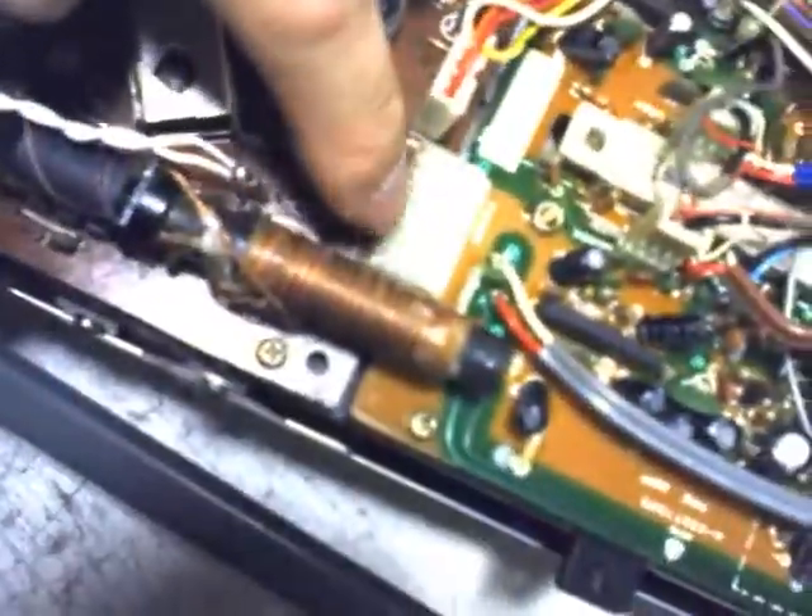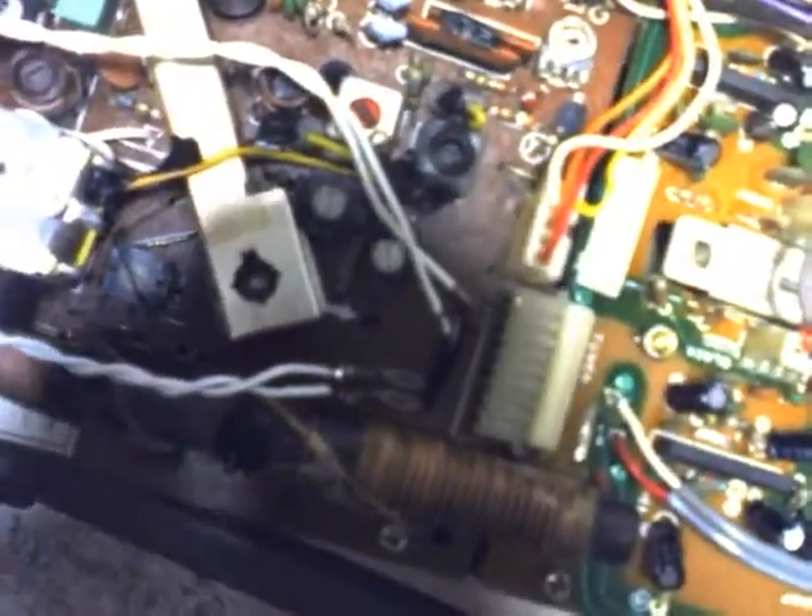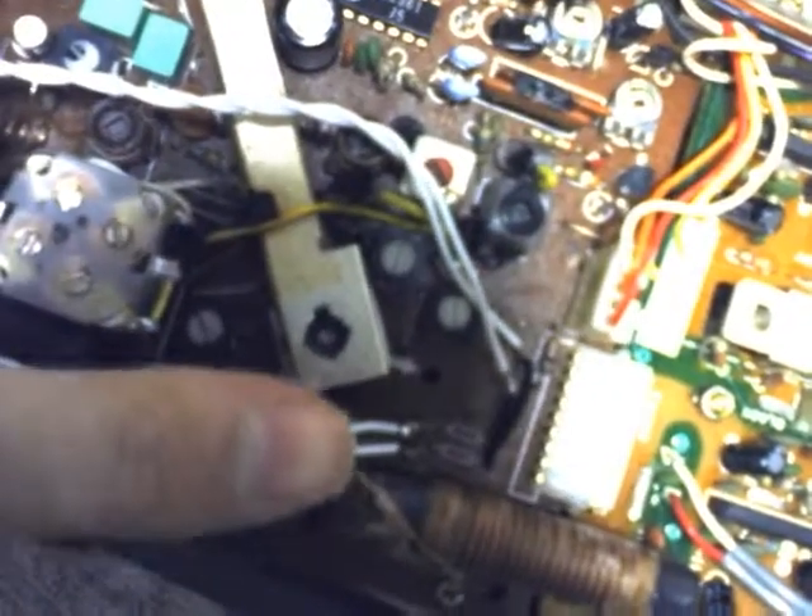What I've actually done is installed a chip — it's a 4016 quad bilateral switch. When I'm on FM, the output of the existing radio goes into the chip and then straight out again, feeding the audio board there. You can probably just about see where I've cut the two traces and linked it like that — output from radio, input to amp.